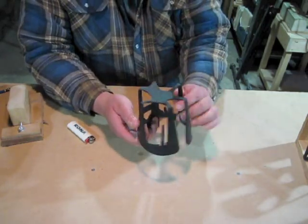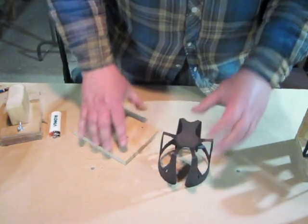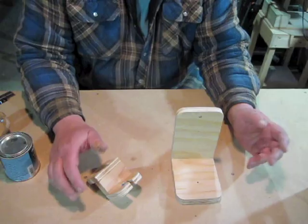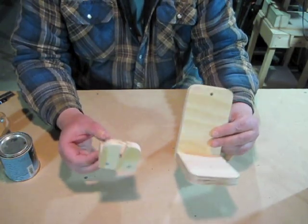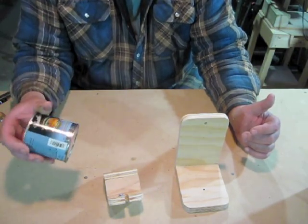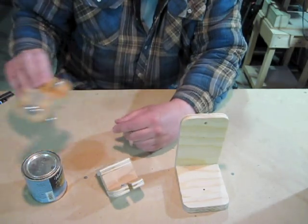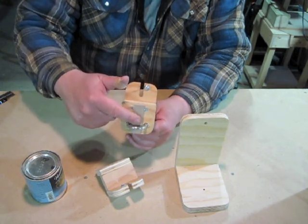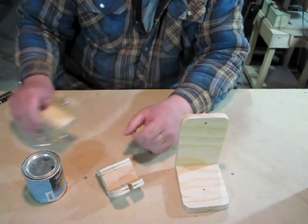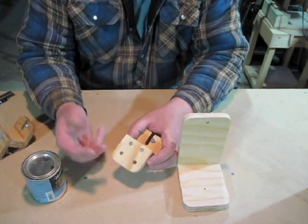Just be careful. Lastly I need to drill a screw hole through the bottom of the cup holder. It's a bit tricky because I need to support it, so I'll stick a board in it to give me something to drill against. Before any more assembly, you want to give these pieces a couple of coats of clear polyurethane — anything you have will do, but use outdoor if you've got it. I'd recommend taking the screw out first. On this completed one you can see I put a little strip of mouse pad here — this is going to clamp onto the leg of the chair and helps it grip more securely. If you put polyurethane on you may want to sand that area a little bit, or try to leave a strip bare and stick the mouse pad on afterwards with two-sided tape.